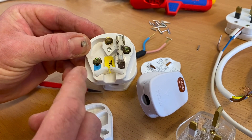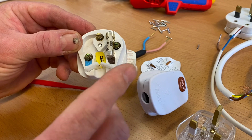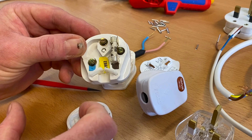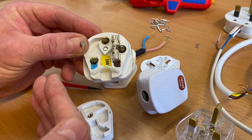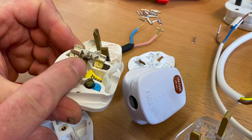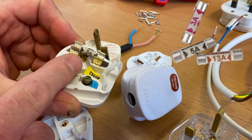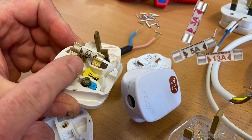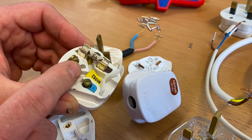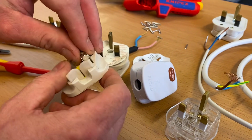I'll show it in two different ways. When I do the other plug top in a separate video I'll use different tools to show the process of working out how hard to press with a knife and how to strip conductors. You'll notice it's got a 5A fuse - a BS 1362 plug top fuse. They also come in common sizes of 3 and 13 amps. They make most values between 1 and 13 but not all, and researching which sizes exist is usually a take-home task.